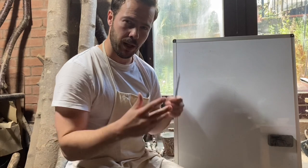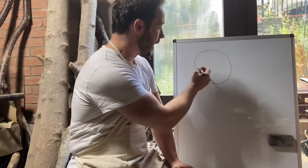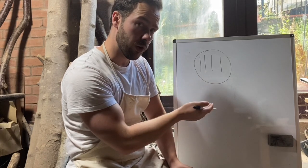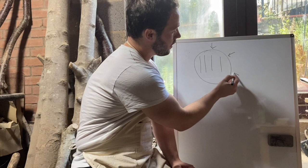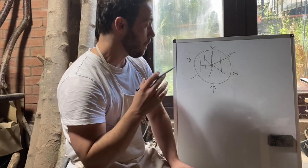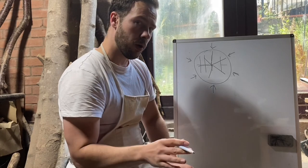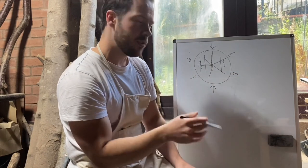I'll take you back to school a little bit with this whiteboard — it's easier to draw a diagram to explain the direction we're carving. If you imagine this circle is the bowl of our scoop with the wood grain flowing horizontally, normally with whittling we always carve in the direction of the grain so the wood doesn't fracture and splinter. However, I found that when carving bowls and scoops the easiest way is to carve in a circular motion towards the center. We go with the grain and also across the grain, which may cause little tears instead of a smooth carve depending on the wood type.